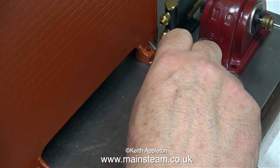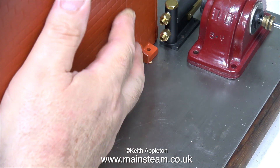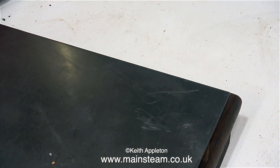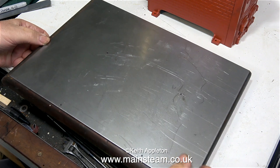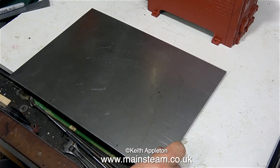In this clip I'm using my right angle scriber to scribe the position of the mounting holes for the boiler. Before I receive any expert comments — don't bother. I am aware of transfer punches, but I don't want to use them because bashing them with a hammer really close to the boiler is not a good idea. I don't want to have to repaint it again.